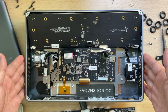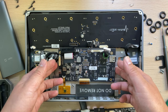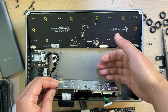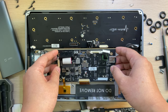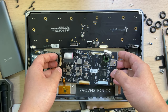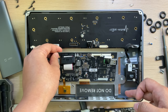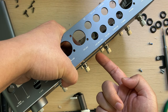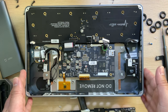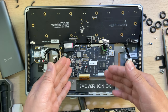I need to say something about the issue that the device can quickly get hot. Actually the truth is, the heat is not from the processing board. On this board, we can see there is no contact to the power dissipation board, and this board will not have too much heat. So the problem is because of the display. We can see here there's a huge heat dissipation metal also connected to the box. This big screen will get very hot and the heat transfers to the whole box. So after some running time this whole box gets hot. We don't have to worry about that because the processing is okay.